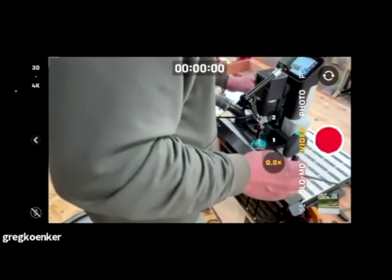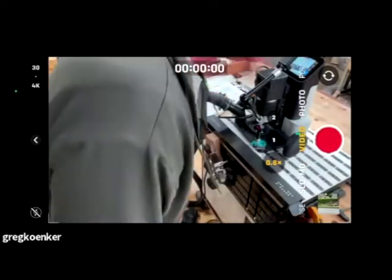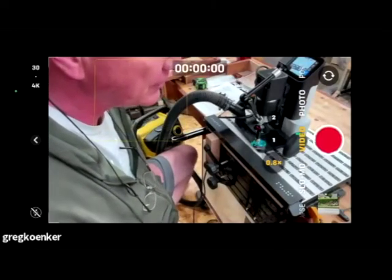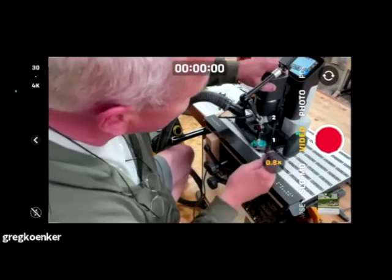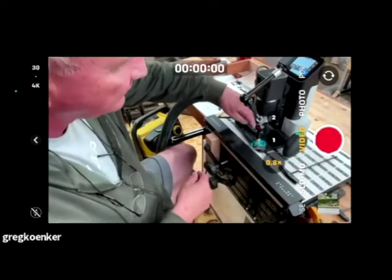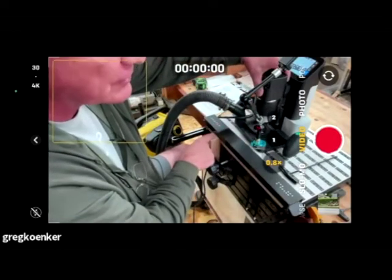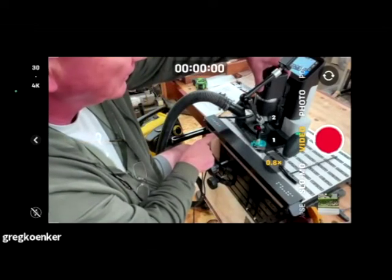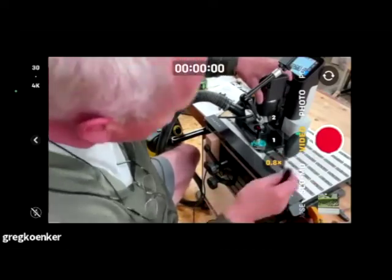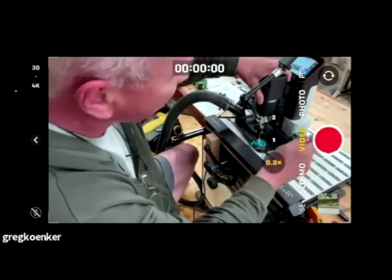One thing you do have to remember, I have been guilty of forgetting this probably once every 10 or 15 times I use the tool. I change the bit and I forget to tighten this screw. So what happens is when it lowers the motor to 0, the bit hits the top of the wood, and instead of registering as 0, it just pushes the motor up and out of the way. It's like, okay, I forgot again. So I won't embarrass myself by forgetting this time.